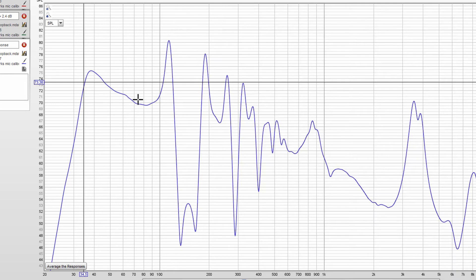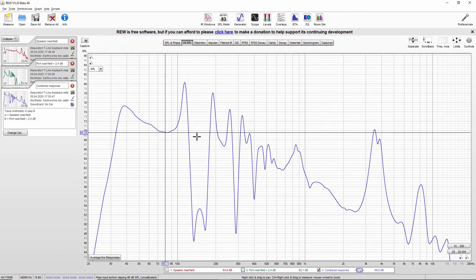Not the worst, but the transient response dictated by this steep curve looks pretty bad. I guess it could work as a subwoofer if you use a very abrupt low-pass filter in this area. As we saw, making a transmission line enclosure isn't as easy as making a quarter wavelength line and calling it a day — we have numerous problems with peaks and dips. We have to use dampening material in different thicknesses and in different positions along the line. The speaker position along the line is also important; you can offset the speaker and not place it at the beginning of the line.